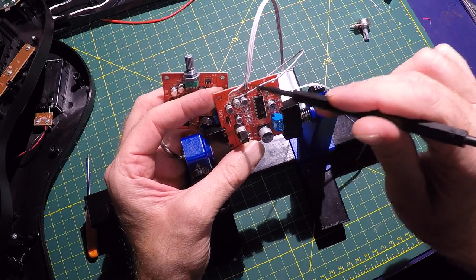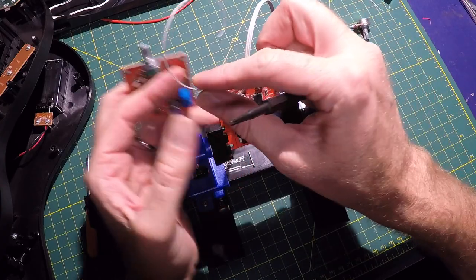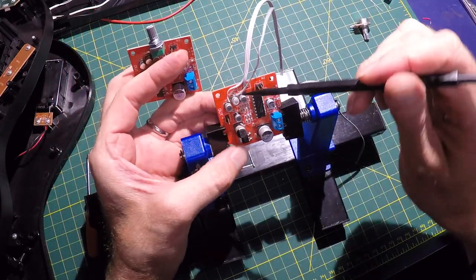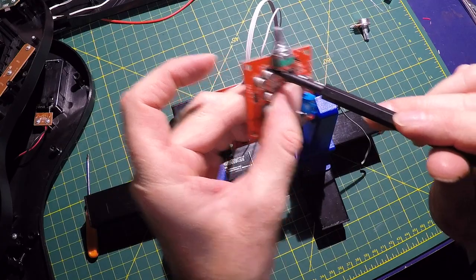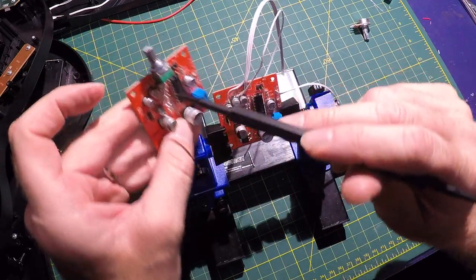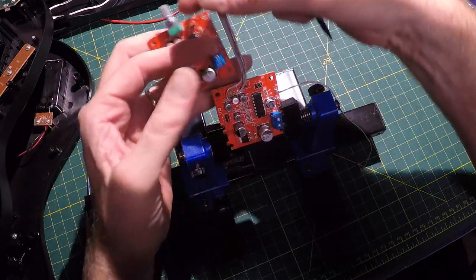It's a little tricky doing that. But you have to do the same thing for the feedback, a similar type of thing, just one wire to this, between C15 and R21. The one that pulled off was going out to C17. So I was able to do that.